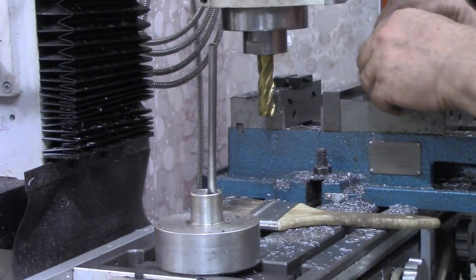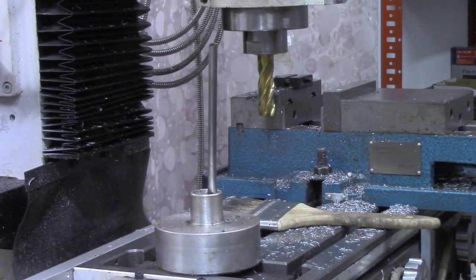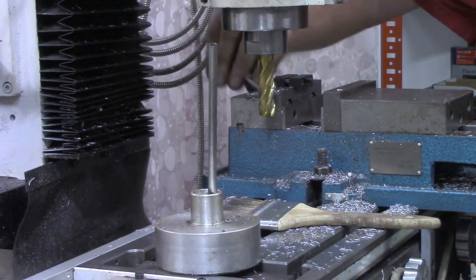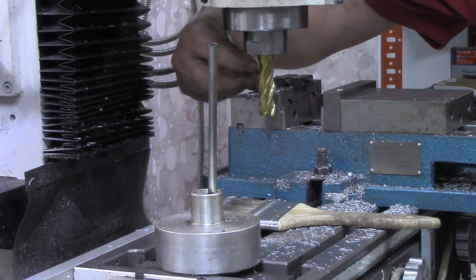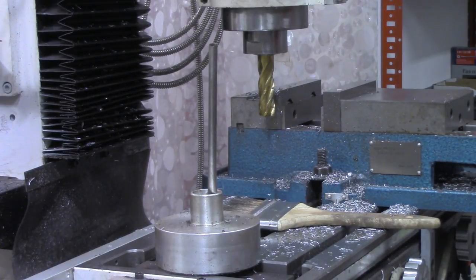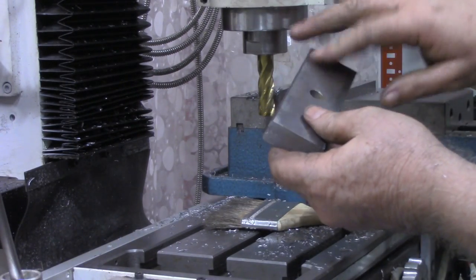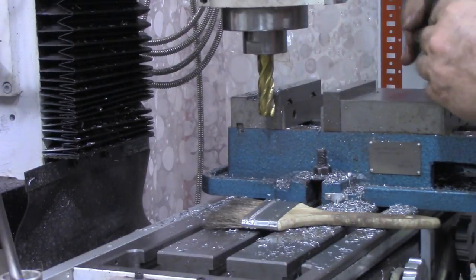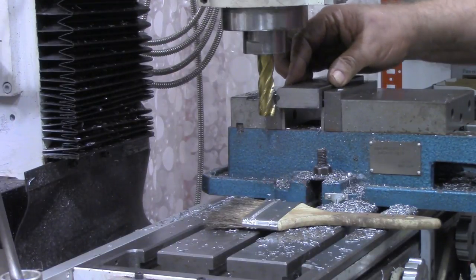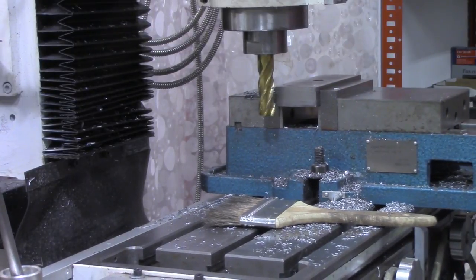Of course, need some deburring. Deburring and cooling off as well. Now we'll put this in. This hole is reasonably close to center when I cut it off. We'll square off both ends and then drill out the hole, drill and reamer to match our Acme rod.